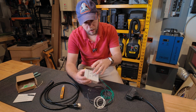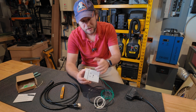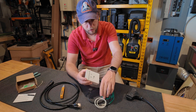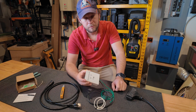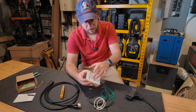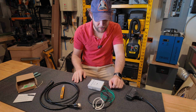There are a couple of indicators on here. One is a little light that says it is armed — that's just when it's on and looking for the induced voltage. The other is a low battery indicator. If you turn this on and that comes on, then you know the battery is dying, which could be an issue — you may not know if the power comes back on.